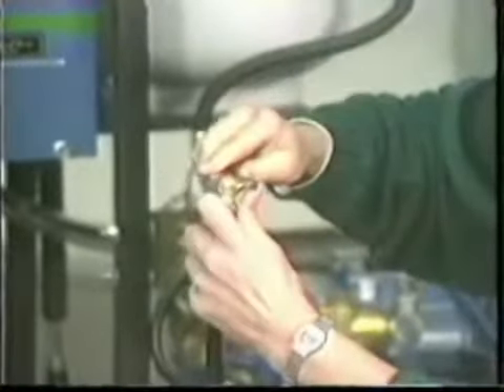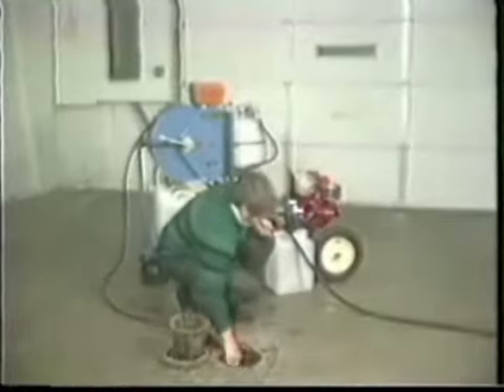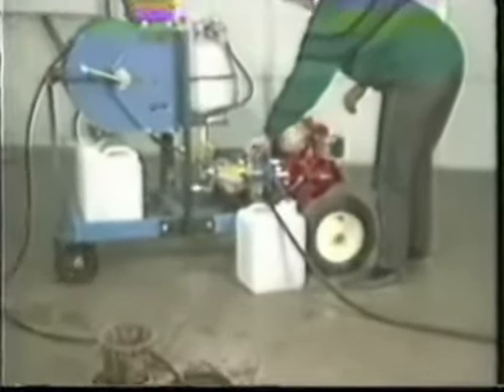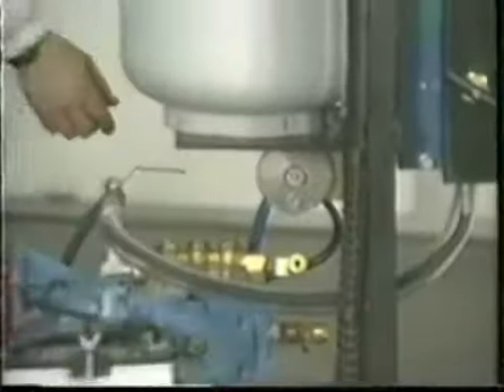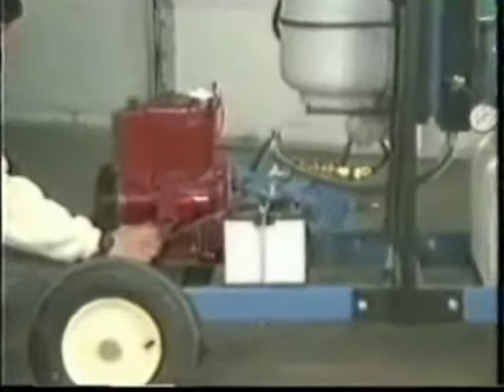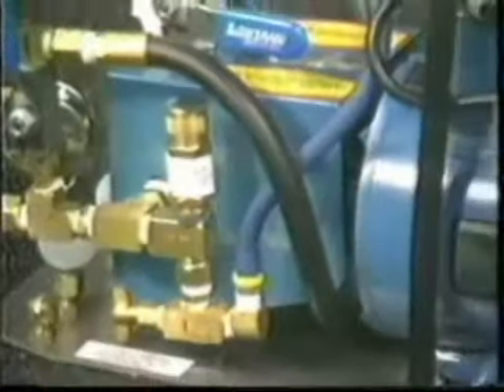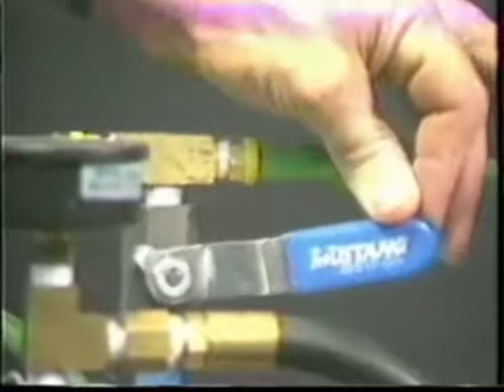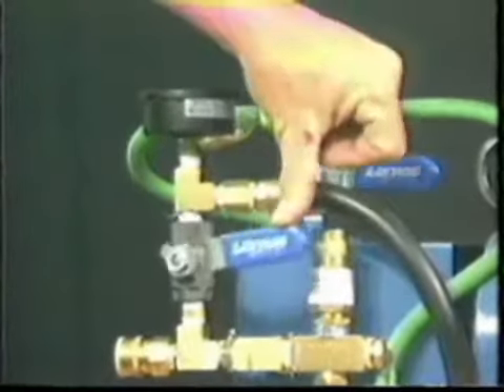Place the hose a few feet into the trap so it does not shoot about the room when the pump is turned on. Turn the water inlet on and open the outlet valve to start the pump. To start an LP-fired unit, open the valve and prime the special carburetor by depressing this button a couple of times. The procedure at this point would be the same for a gasoline-fired engine — turn the engine to the on position and depress the electric starter. If you have a gas engine, you will need to choke your carburetor. If you are using the 10E, 12E, or the 2250 electric models, use the on-off toggle switch to turn the motor on. Make sure the pulse control lever is in the horizontal closed position, delivering 1050 PSI from the pump. The pulse eliminator should be horizontal for pulse action to be delivered to the jetter hose. If operating the 2200 series, the pulse generator should be rotated completely counterclockwise to the out position, delivering 2200 PSI to the jetter hose.